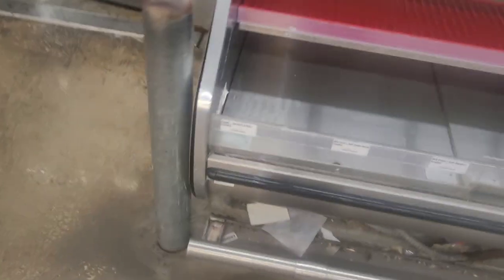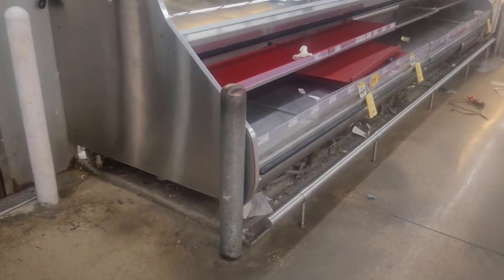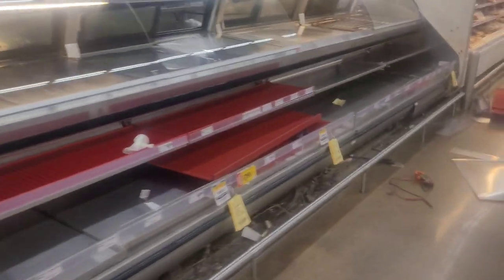And so, I've got no liquid line solenoid operation, or fan motor operation, you see? No fans. So we've got no power coming in. They need an electrician before I can do anything else. Most likely, they give me power to this unit, and it'll start working again, unless there's a problem within the unit, but I can't do nothing with it until I get power.